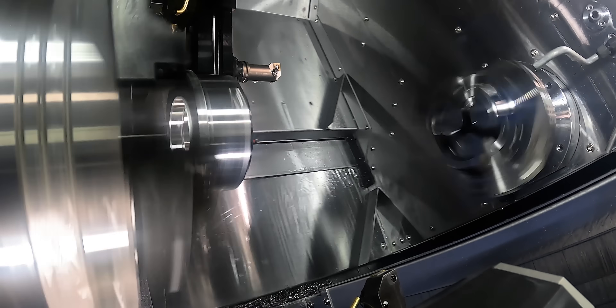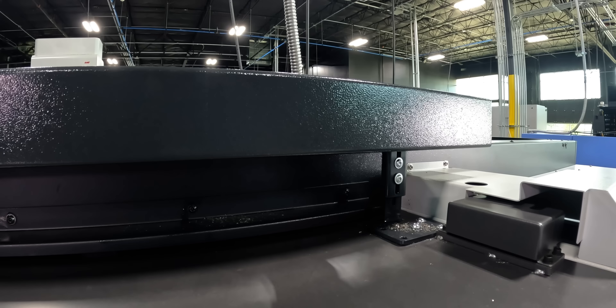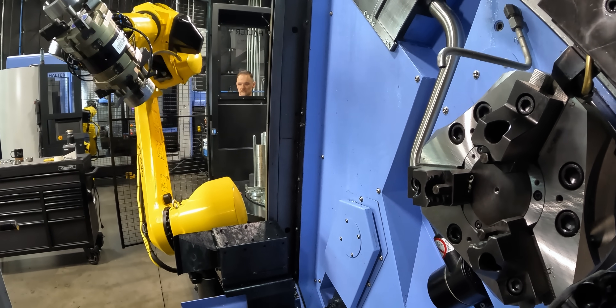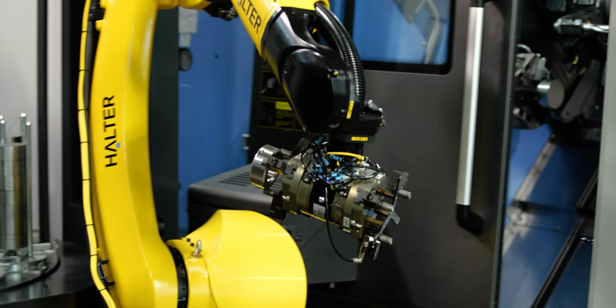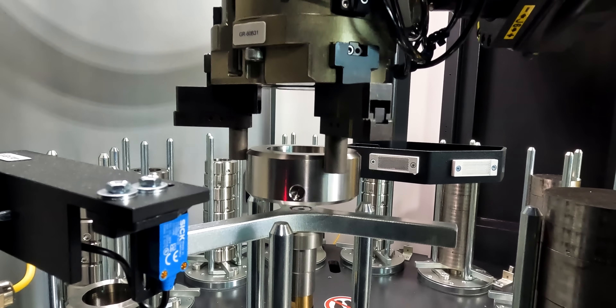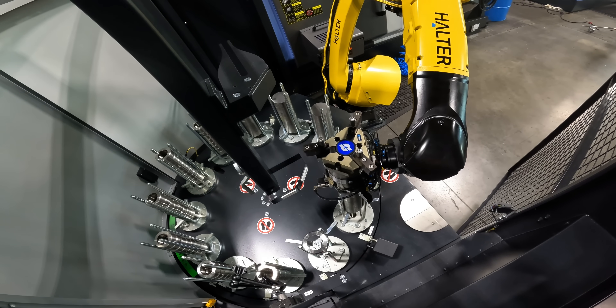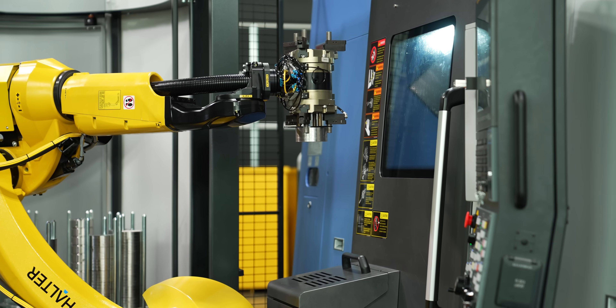The complete cycle is a multi-step process. First, the robot goes in and grabs the finished part from the sub. The doors shut and a chuck transfer is completed, moving op 1 to its op 2 side in the sub. The doors reopen, the robot places the raw stock into the main, comes back out, the doors shut, and the whole machining process starts again. Meanwhile, the robot returns the finished part to the finished stack, grabs another piece of raw stock, and parks itself — ready to rinse and repeat.